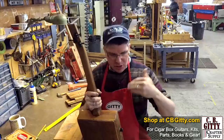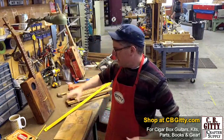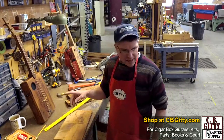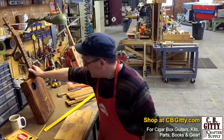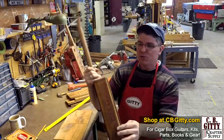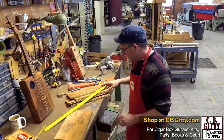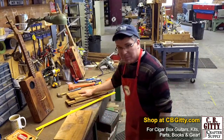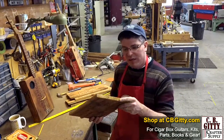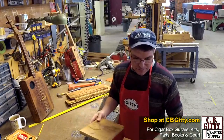There's no angle, like I didn't do angle cuts or anything. And this box, the size of it actually ended up a little bigger in one dimension than I had planned for. And then I had to do something to fix that. I can't remember exactly. I think that's why the back panel doesn't exactly fit. The back panel's a little smaller, because the box ended up bigger than I expected. So getting all of this right matters, because if I build the sides first, slap those together, and then find that I'm off a half inch longer or a half inch wider, you're kind of hosed.